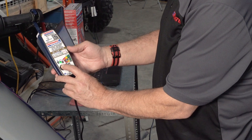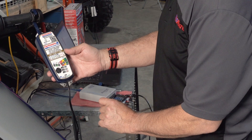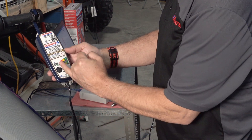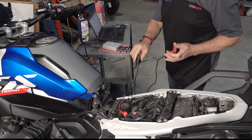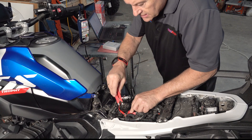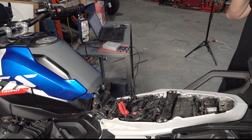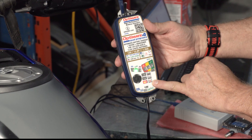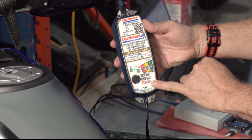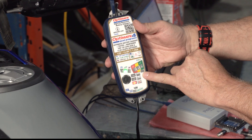I've selected LFP mode, program number 3, where I can charge directly to the battery. Only the LFP light will be on at this time. Now I'll connect the charger and allow it to recover the battery. The recovery mode is now active and this may take about 2 hours before it will proceed to the charge step.